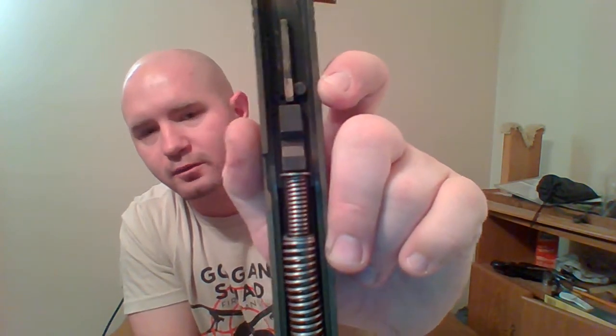Some of you hit me up about poor maintenance on my M&P video. Yes, I know maintaining a firearm is needed, but I've spent the last four days cleaning rental guns at the range I work at — they are way dirtier than this and they still work. Also, on the Gen 5 Glocks with the ambidextrous slide lock, the trigger bar contacts the slide lock — that's a design flaw. That gun was giving me that malfunction within 300–400 rounds. This gun has not stopped locking into the rear at all, even with the P-mags, and it's soaked in carbon.